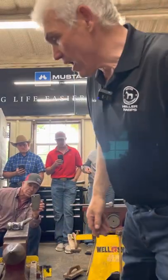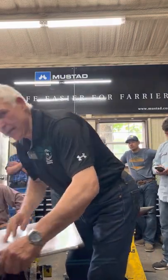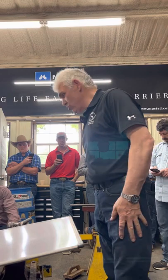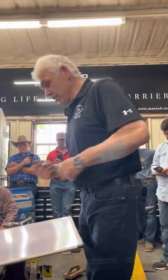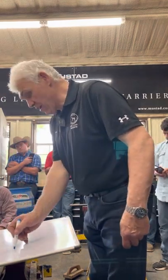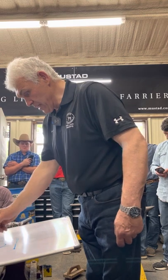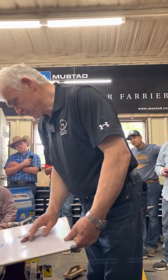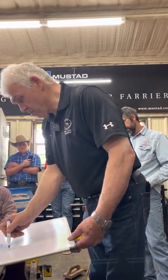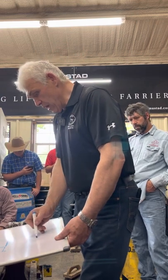Okay, now, scarves. You all know about scarves. So we're making a straight bar, aren't we? A straight bar should be straight. Then we've got our heel quarters. What you remember about your scarf on a straight bar is it must be perpendicular to the back. So there's one scarf there. You see, that and that have to be perpendicular. Because then, when you do the second one, how much do you have to overlap it? Not very much. Anybody do a scarf like this?